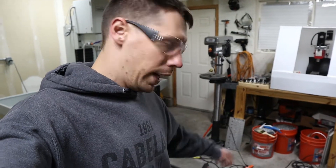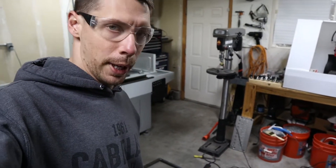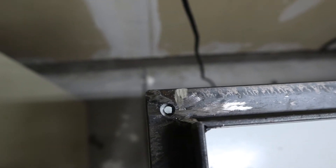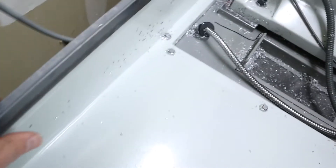It's all drilled out — time for that moment of truth. I'm going to grab the piece and throw this back on the mill. I might have been off a little bit, but I don't think I was off that much. Check it out — nothing's really screwed in here so it might take some finessing. But you can see here, I'm glad I went with the bigger hole. You can see all the way around the hole there. Here it's a little iffy. I think I just need to start putting bolts in. If I shimmy it that way then it fits, but then it doesn't fit here, so there might be some wallering that needs to be done. But they're all pretty darn close.